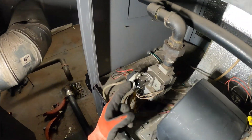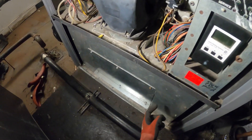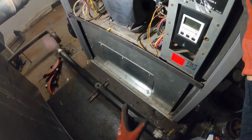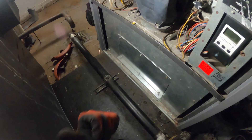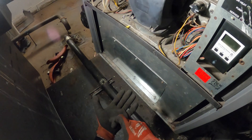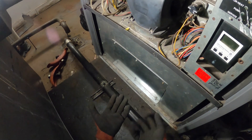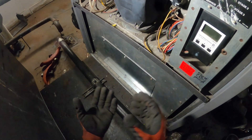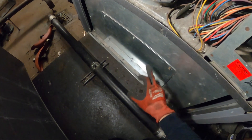This is a two-stage hot water boiler. As you can see, we got two gas valves — that's how you know. Inside here is the burner section. I did inspect a previous one that was having ignition issues and it was literally exploded inside. So it has to have these little perforations inside, like little dots, so it can let the gas through. But if there's openings or cracks, it's got to go. It's not good.